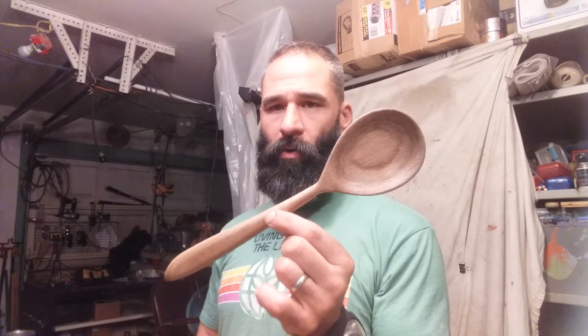The first one I made was for my mom, out of red oak that I got from my dad. My mom might have a little problem with that because I didn't talk to her yet - I'm gonna send her some stuff to deal with it. I was oiling it with refined coconut oil, which is not a good idea. Little black spots kind of show up because the oil goes bad where it's set into the grain of the wood. I'm a novice, so you can critique me all you like.